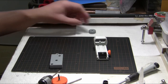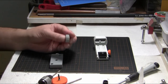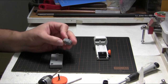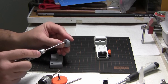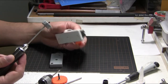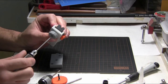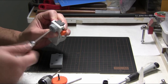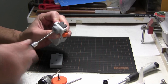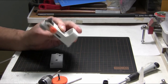Now for the mounting. One other part to add is the adjustment wheel — this wheel is just a dummy adjustment wheel that looks like a real sight but doesn't serve any actual function. I'm going to screw that onto the back with an M3x10 bolt, and just leave it so it can't be turned freely.